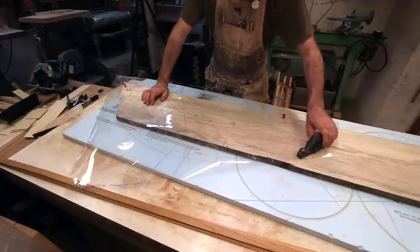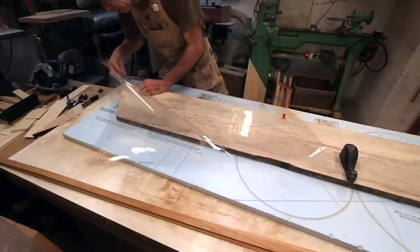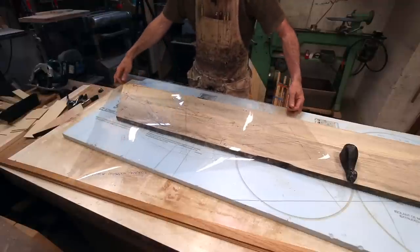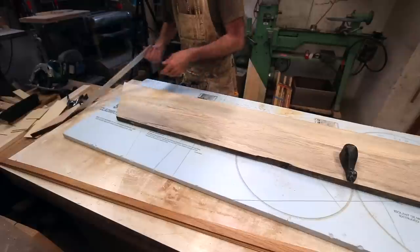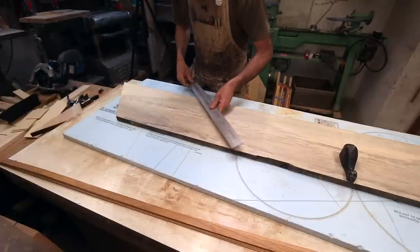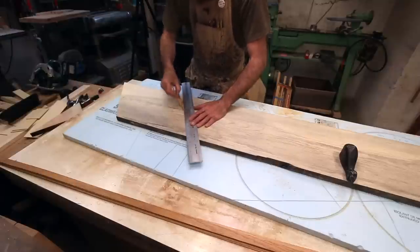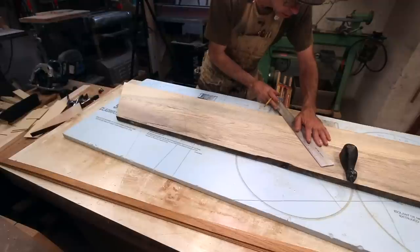It'll take you through the process of building both canoes and a flat bottom skiff. It's a really good accessible way to get into boat building using the glued lap strake planking method. Now I'll just take a minute to make sure I know where my marks are going. I'll start by drawing in my various reference lines — I've got this center line here and this reference line. I always use two little pinpricks for a reference line just so I know it's not part of the shape, because it's easy to lose these marks when you've got little nail holes all over the place.